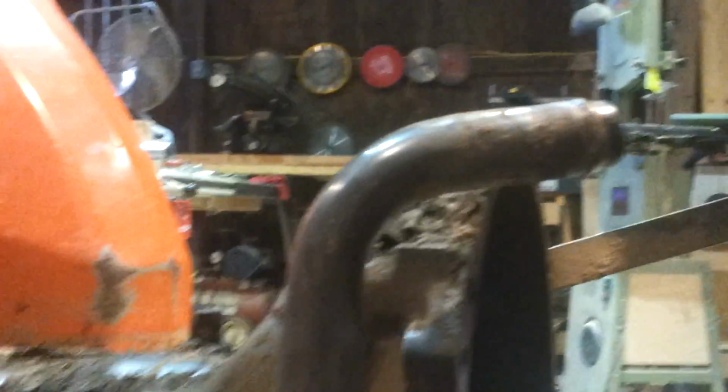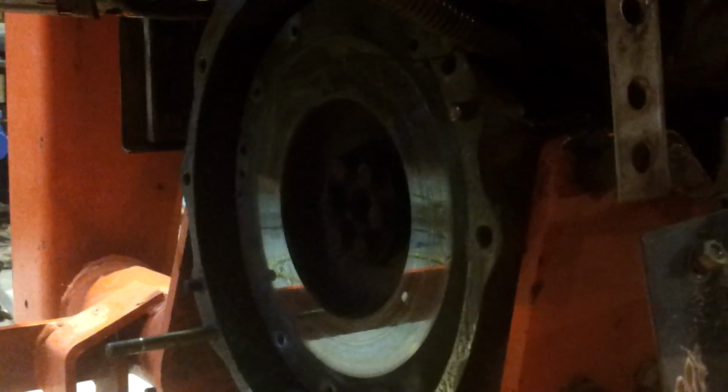But you can see this is a suction tube for the hydraulics. It goes back through the filter and into a low spot in the transmission to pull oil up. The hydraulic pump for these is actually up on the engine. I'm looking at it now, but you can't really see it. It's kind of a bear to get to, especially with the loader frame still attached. So this helps. This would have helped me.